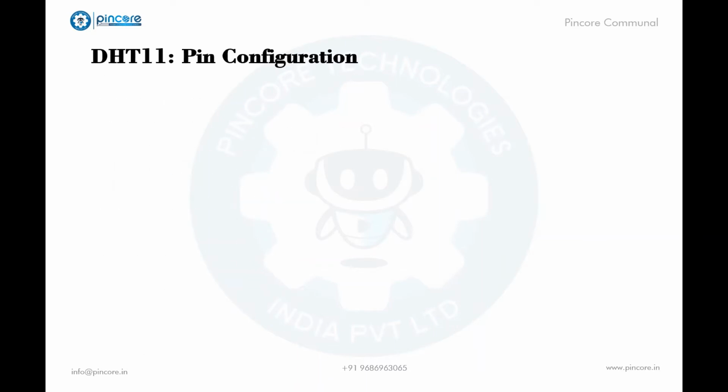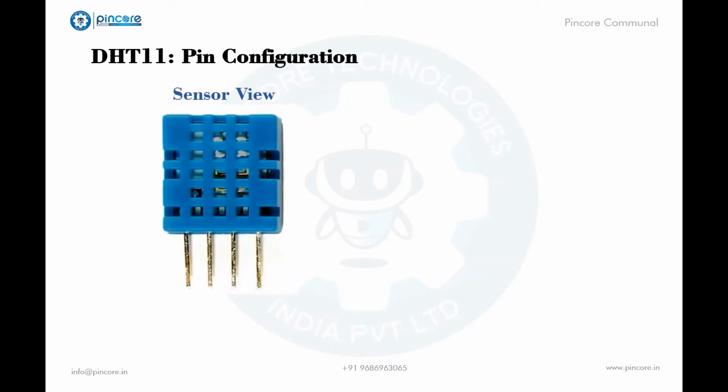Now I'll let you know the pin configuration of both the sensor view and the module view of the DHT11. As we have already seen the physical difference of both, the sensor view of the DHT11 has 4 pins. First is ground, which is connected to the ground of the circuit. Then comes NC, no connection, and hence it is not used at all. Then comes the signal pin or data pin, which outputs both temperature and humidity through serial data. Then comes VCC, where a power supply of 3.5 volts to 5.5 volts can be given.